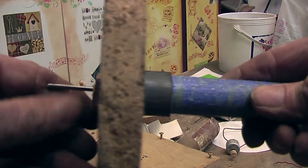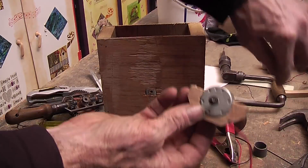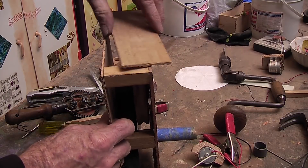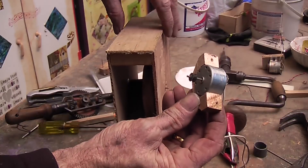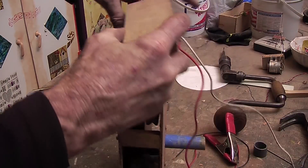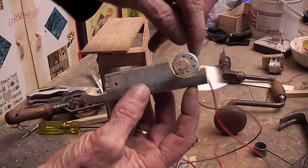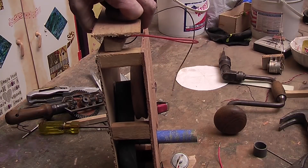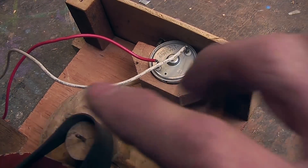So it will go on like that. Now the generators — depending on what motor you have, for example something like this — I have made a little bracket in wood. On the top here, at the small pulley end, I am going to make a lid or board screwed on with a couple of screws, and that motor which is going to be the generator can screw to that lid so that it will sit down at the right level. If you are going to use two, you might want to make a bracket like that for two motors, one for each side, and screw it to that base, so that it will go in to the right depth also. That is so that the rubber band can now go around this pulley to that one, and then reassemble everything.